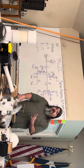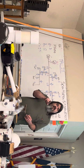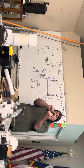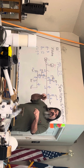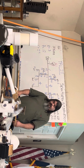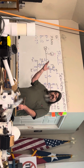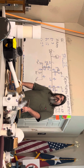The only way to get around that is to come out of the wall with 1 inch and put 2 smaller heaters, like 2 40 gallons, and bullhead a 3/4 by 1 T and run them parallel from the hot and the cold to 2 smaller heaters. But you have to take 1 inch to and from the heater if it calls for 1 inch, because it needs that volume to feed that many fixtures. Is there an exception for tankless?